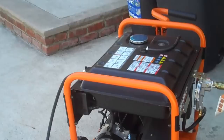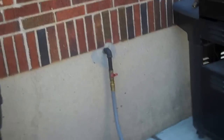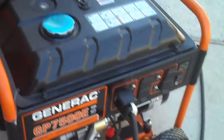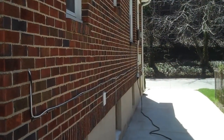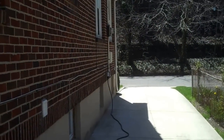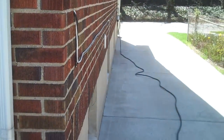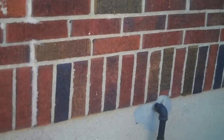This video is about super storm preparations. I got a gas line to my portable generator with a 30-amp cable — actually rated for 40 amps — to my inlet box. That's an outlet if you see it that way. This wire I would probably zip-tie to the house during a real rainy emergency.